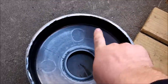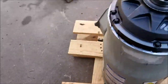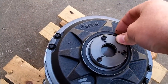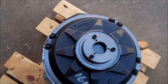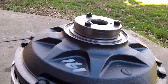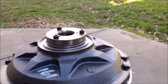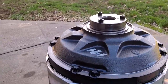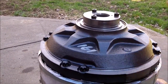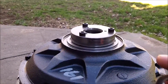Here's the inside of the top of the compressor. This is your low pressure side refrigerant and this is your high pressure discharge — it comes out here. It's a bit different than a Copeland scroll, because the Copeland scroll has a moving seal that goes up and down, which forces the scrolls together and causes them to wear in rather than wear out — which is why they last longer. It also acts as an unloader, so the compressor can start with no load, then build full pressure as it spins up, which is easier on the motor with less amp draw at startup. Also on Copeland scrolls, if liquid refrigerant is ingested the scrolls can separate vertically or side to side by one millimeter to prevent damage. This one here, from what I can tell, doesn't have any of that — there's no moving seal, just a fixed seal.